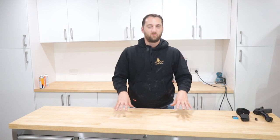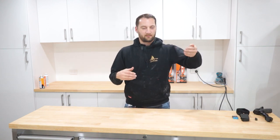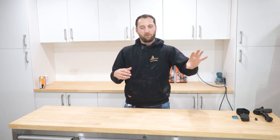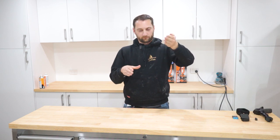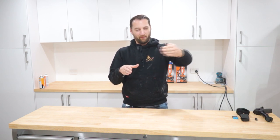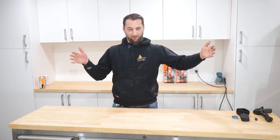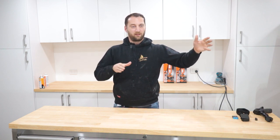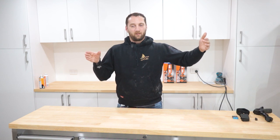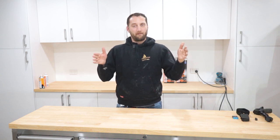Halfway through building them, we came up with a better option. So we were going to make basically the bench seats and then with a back support. And then there was going to be a little bit of wasted space behind the back support. What we decided now is we're going to just have the back support as a separate item, and that we can pivot it back. It's going to swing back, opening up the settee bench, which was about 500 wide. It's going to give us about another 300 mil, so that makes it about 700, 800 or 900 wide, depending on how much foam cushioning is on it, so that we can pivot that back support out of the way, and that could be an underway bed.